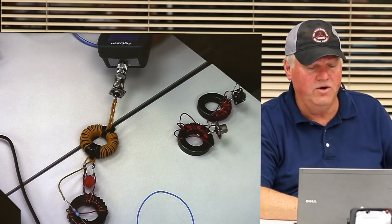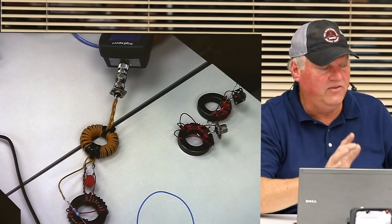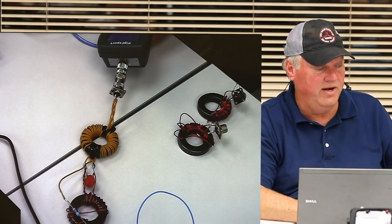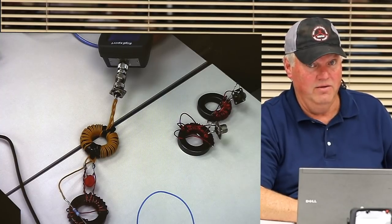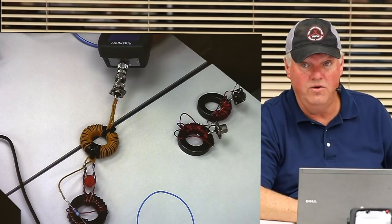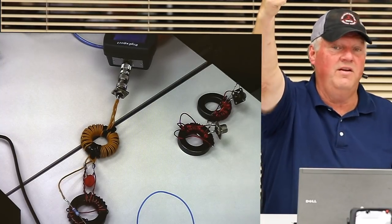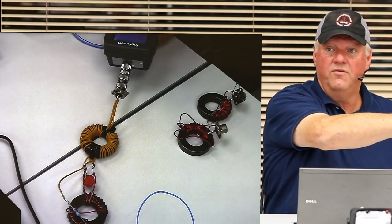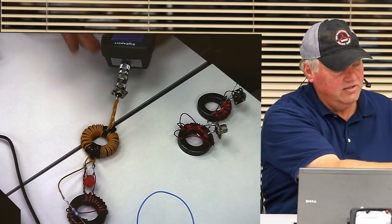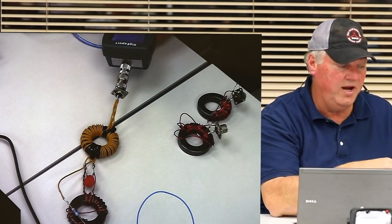And because that wire is unbelievably flat, guys, it's very forgiving. Is it the best radiator on the planet? Maybe not. But man, if you need to get an antenna up and you live in a restricted area and all you can do is feed it at 5 feet on the ground, go up to a tree 25 feet and come back down to the other side of your fence, wind a couple of these coils. That stuff's like $20 to buy and make, okay?